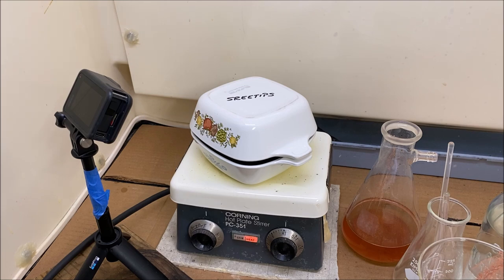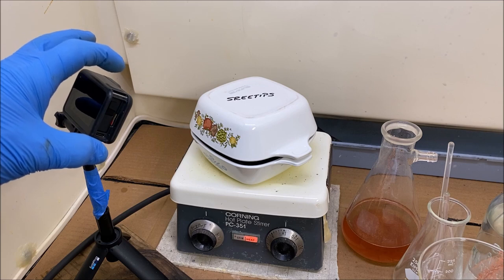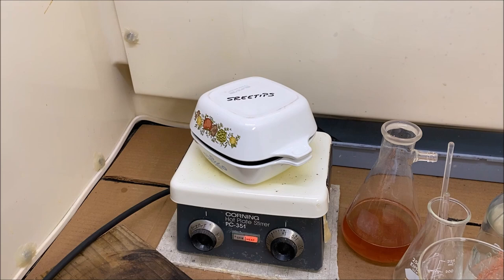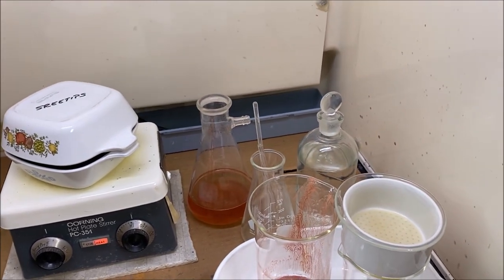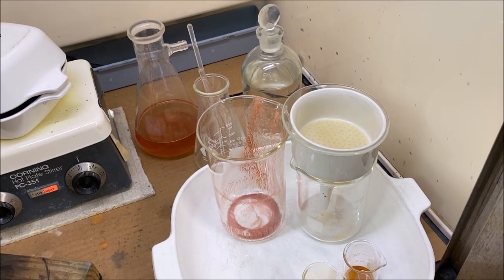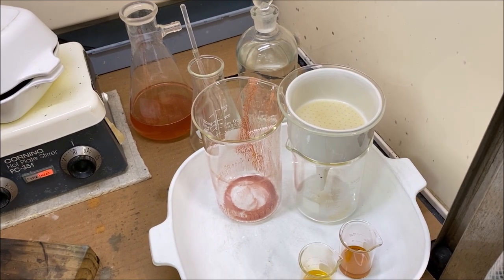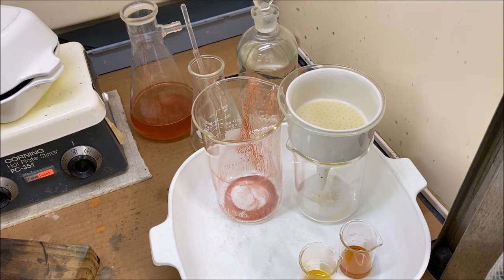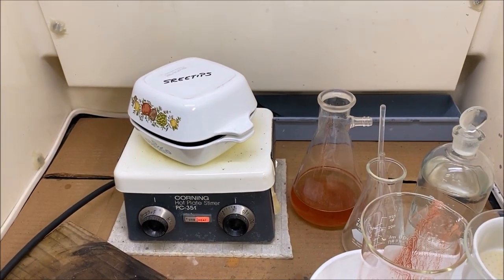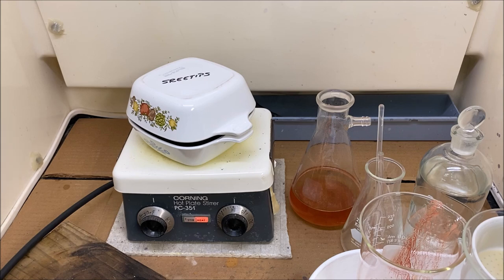I'm going to call it right here - I've been working on this since about 8:30 and it's currently about 10 p.m. I've got a time lapse of the calcining we did. I cannot seem to get it hot enough to complete burning off all the ammonium chloride, so I covered it up to form a little oven. Hopefully it will get hot enough to burn off the rest. I've been about 14 hours into this. All these little residues and waste solutions I'll add into my stock pot to cement the precious metals out. This concludes part two of the platinum refining video. Thank you for watching.